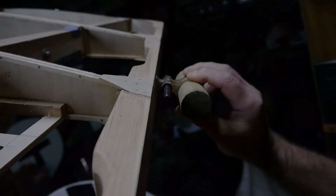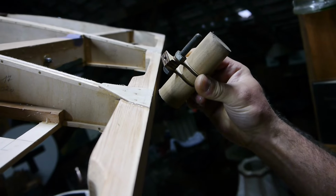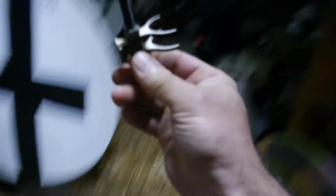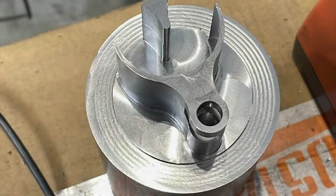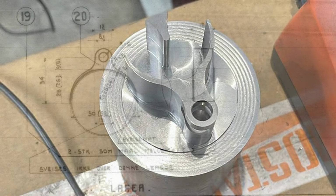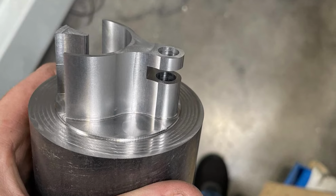Let's leave him to muddle on alone and just go. Far away. Maybe down here. All Fokker control surfaces are welded from tubular steel. As far as the suspension and hinges of the ailerons are concerned, we had some thinking to do. I decided in favor of the version of the hinges that Fokker built for its C-4 and C-5 fighter aircraft in the mid-1920s. And Martin, for a start, made functional models out of wood. They were then made in steel for the aeroplane.